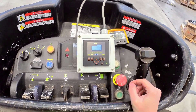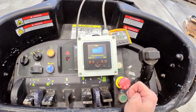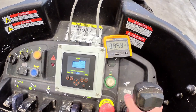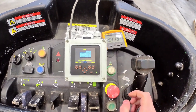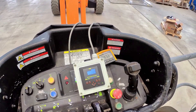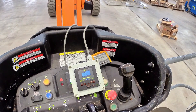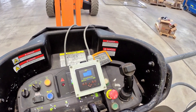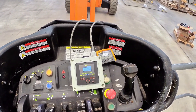What I'm seeing on the diagnostic box is correct — the voltage is going higher. For some reason it's going to 5 volts, and because it's going to 5 volts it's throwing up the sensor error. I think this sensor output should be between 0.5 and 4.5 volts, so the output has to be in that range. That's how the PLC is reading the voltages and detecting the sensor error.